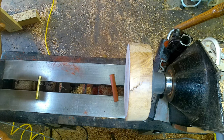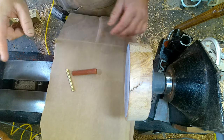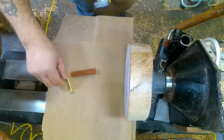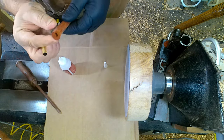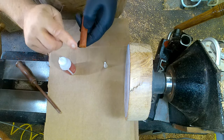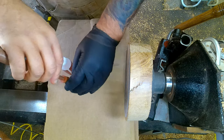We've got to glue this in there first in order to hold it accurately with the boring set. This is what all the parts of the pen are pressed fit into. I have room — this is not shaped quite the same, but I'm already planning on hand carving. So I already know I'm going to have to whittle down one end and do a little hand carving, hand polishing and sanding. Make sure that it fits so we get it drilled nice and straight.